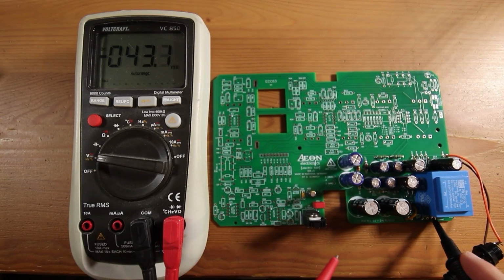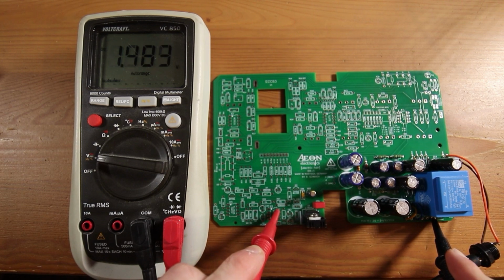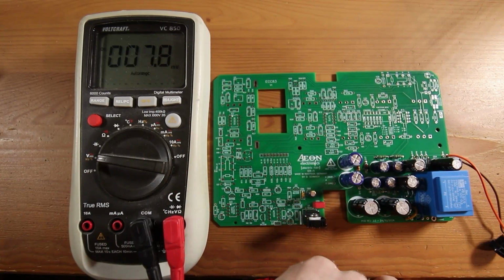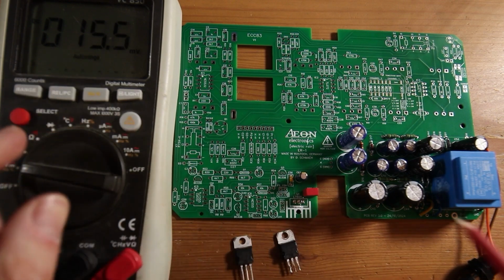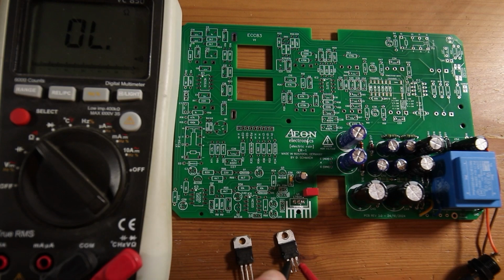And now back to my PCB. I populated the linear voltage regulator for the switching circuit. And what the... This doesn't look right. It should be 5 volts and this thing gets hot instantly. I can tell you this is the first time ever that a fresh part is broken. I mean, I store them properly in ESD bags and handle them, of course, with care.